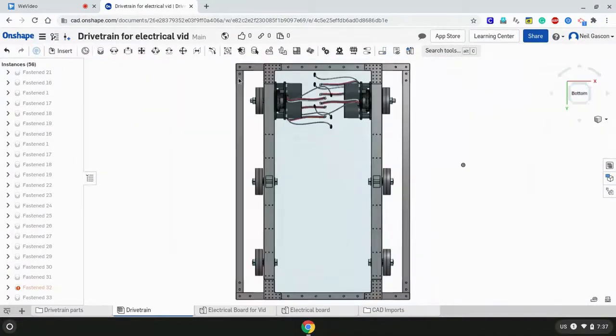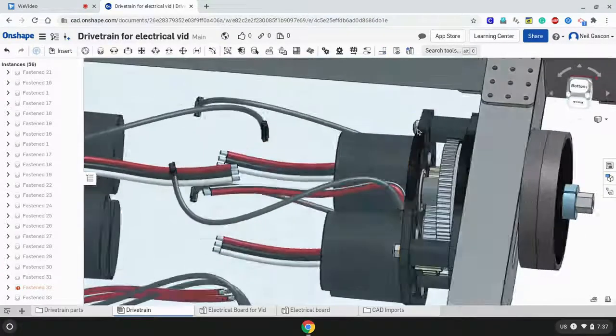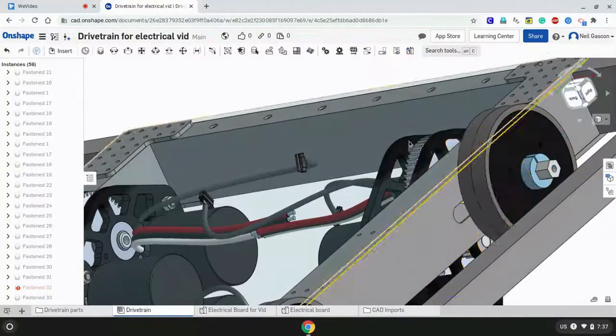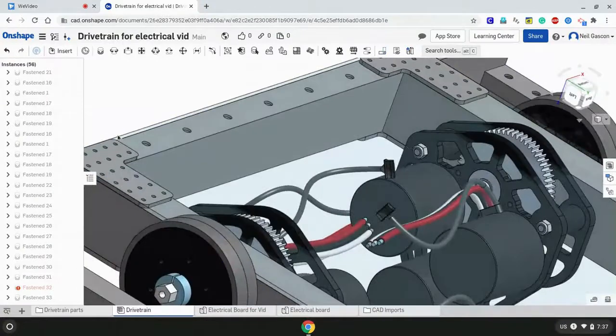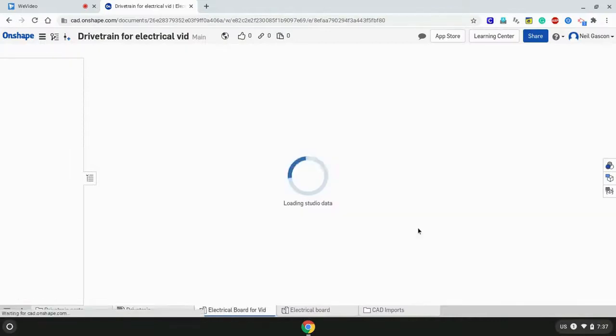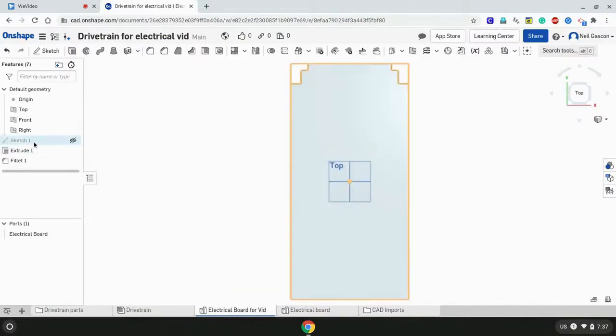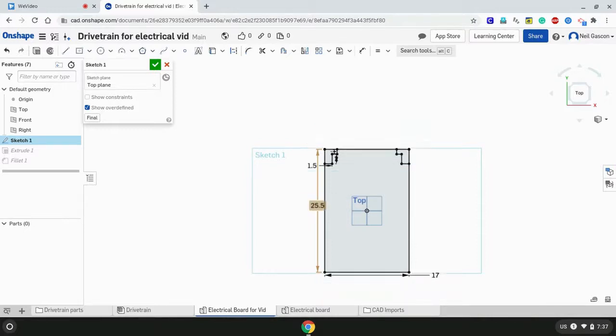And then obviously, as you can see here, as to why we're going to have to cut parts off, as you can see, the motors extruding, going through the Lexan, even the same thing with these back motors here. So we're going to have to cut from the original design here. So go back here. I don't remember the exact measurement I had to delete from there, so we're just going to guess and check. Now let's see, about 9.5 inches. Shave that off. All right. Let's see.